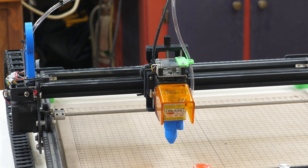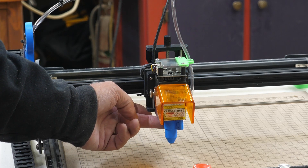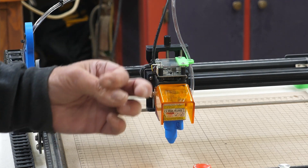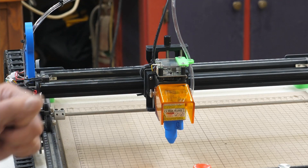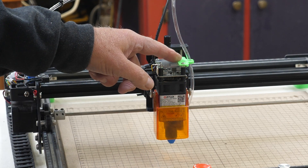I raised the shield all the way up so you can see the air assist nozzle. This is something I downloaded from Thingiverse and 3D printed — I'll put a link in the description. You've got to fiddle with it a little bit, maybe do some minor reaming on the inside to make it fit tight. Then there is a place to put a 3mm set screw in to hold it on the lens. It works perfect.